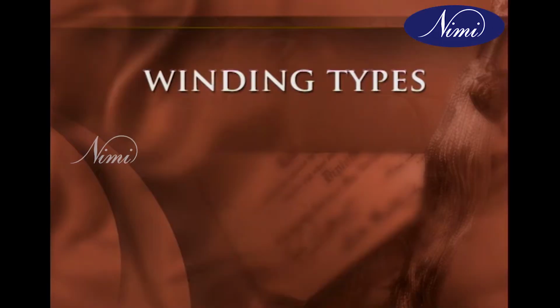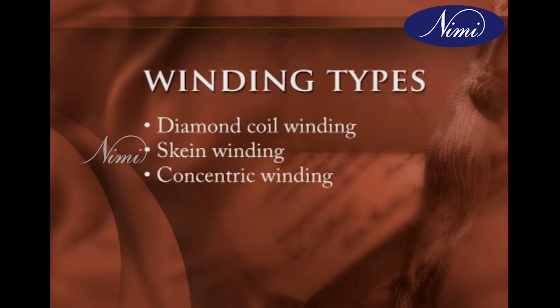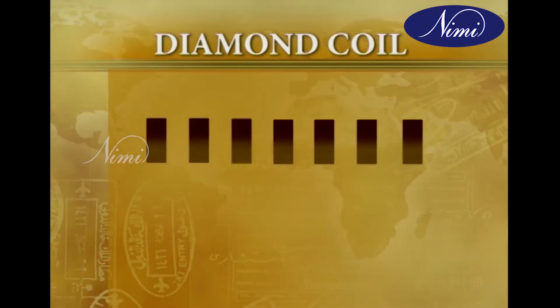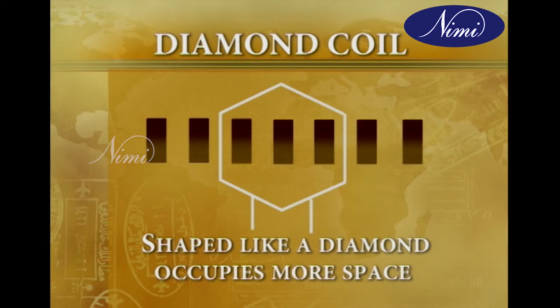Talking about motor rewinding, some types of AC winding are diamond coil winding, skein winding, and concentric winding. In the case of diamond coil winding, the shape of the coil used is just like a diamond, and in this, the coil occupies more space.